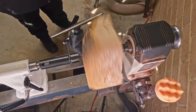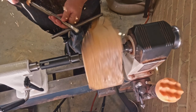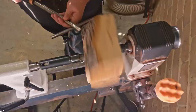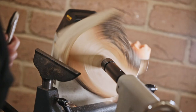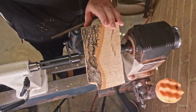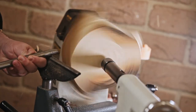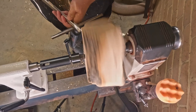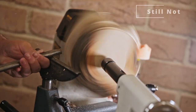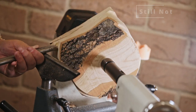You may notice that I am starting square. I'd be able to get a bit bigger bowls if I actually had made a circle jig for the bandsaw. You'll notice here that the piece comes to a complete stop. That's not the belt slipping, it's not from a catch — it's purely that the teeth of the four spur drive have not sunk into that claret ash.